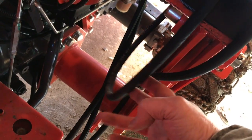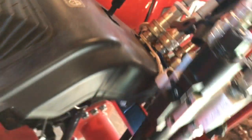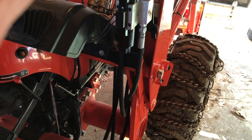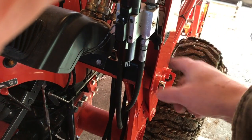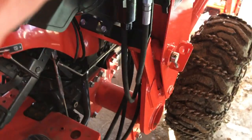The left side — you've got the left side hose on here. That left hose comes with the kit. It's about three feet long or so, and that goes back to where you just took the other one off. So that is the new kit hose. That is the total sum of connecting anything on the hydraulic side with this kit. You take one off, swing it up here, take this one and put it back. Done. Easy.